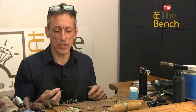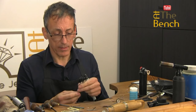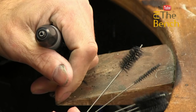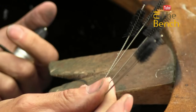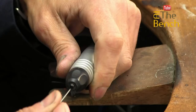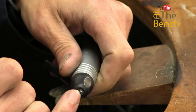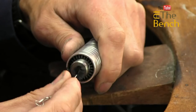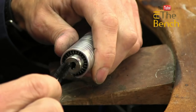And what we need to do is simply get that. I've bought these from eBay, but I'm sure you can get them anywhere. They're just simple, almost little nylon brushes on the ends of twisty bits of wire in various sizes. This is like £1.50 and there's five of them. The idea is you just simply get the brush and put it down inside the chuck, move it up and down, get all the little bits and keep the inside of this little chuck area nice and clean. These little bristles will get in between the little splines on here. Likewise, on this one as well, you can get inside and really get it clean. A compressed air would do exactly the same thing. This chuck is a little bit wider so I can put one of the wider brushes in and get in there — you can see there are actually little bits coming out of this one now.